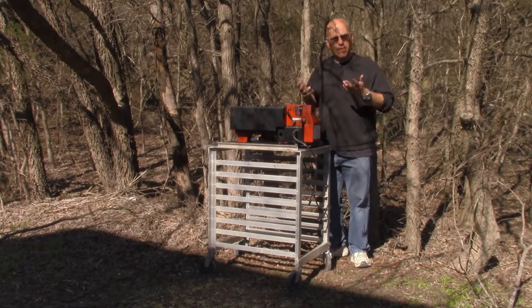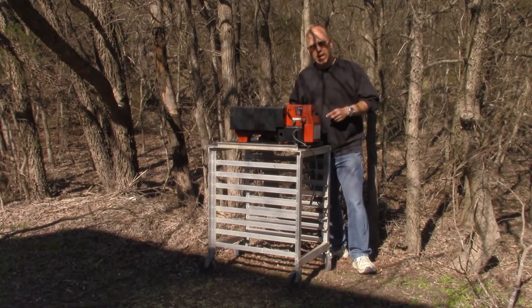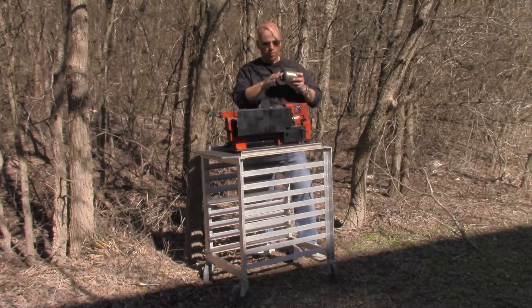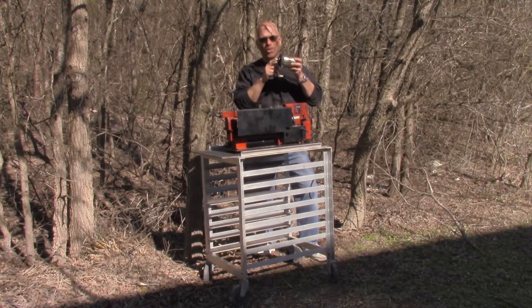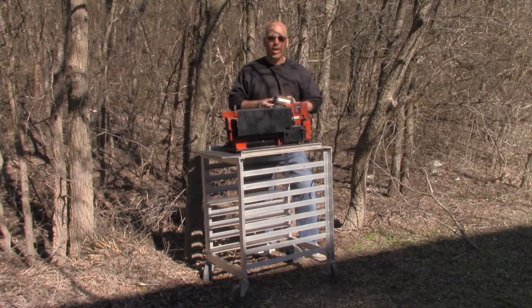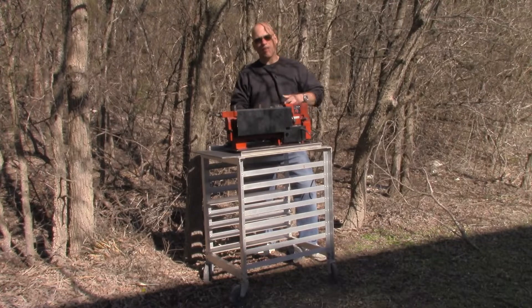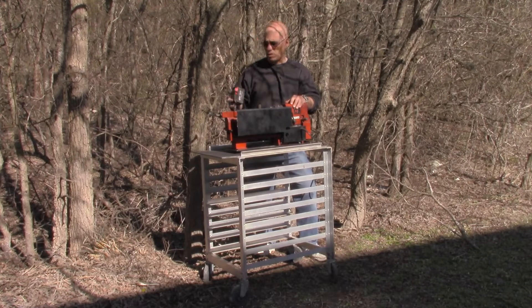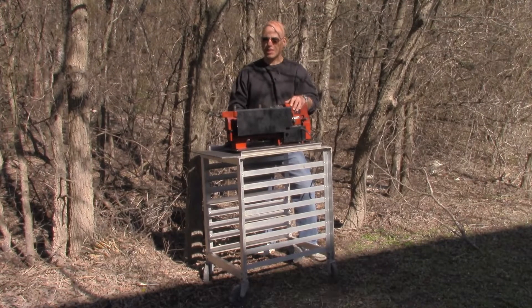I think this lathe ran out of juice. What I need is a battery-operated lathe, however lathes like this operate with a brush DC motor requiring up to 170 volts DC. If I were going to use batteries, I would need to connect nine of them in series — that's too many batteries. So I think I have a way better idea.